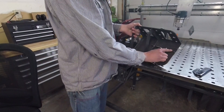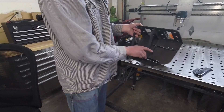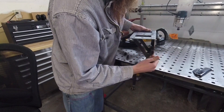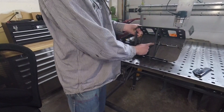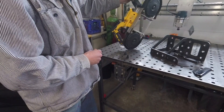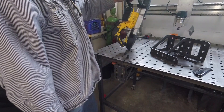It has this support here, and the saw has a slit that this slides over perfectly to stay true with the slit for the saw blade. The version two will extend out further for more support. It did stay flush when I welded it, but there's a little more play in that than I would like, so having this extended should stiffen that up. This is the 20-volt model, but I believe the 120-volt wall plug-in version has the same body. I believe this is the four-and-a-half inch capacity saw.